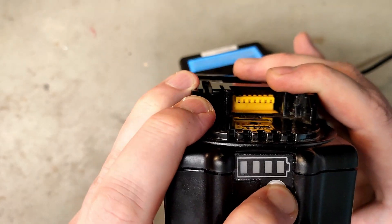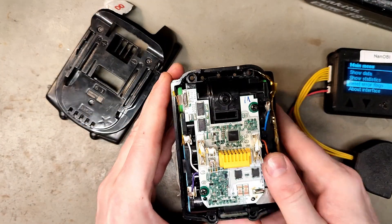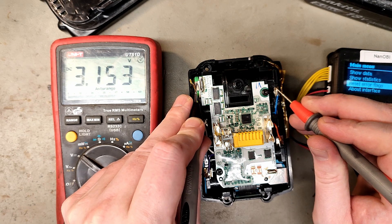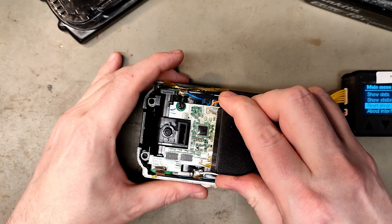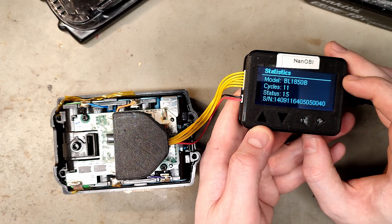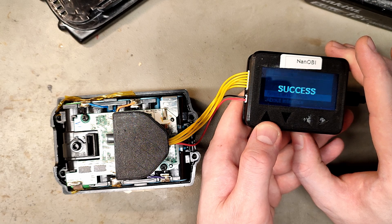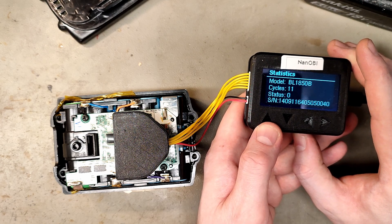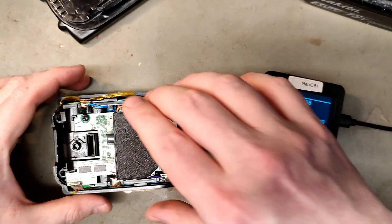It's been a success on all the batteries I've tried, and that also removed the annoying blinking light. Let's try it on this battery — I've replaced two of the cells and got an error. Little Frankenstein here, little Frankie. The cell voltages look decent. Here we have status 15, which might be the number of error flags. Now it says success. Let's go back and check the status — now status is zero, which might mean working state or zero error flags.